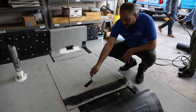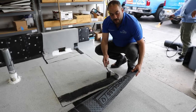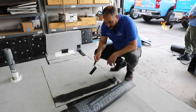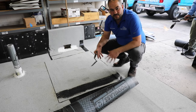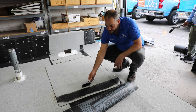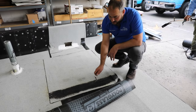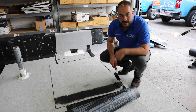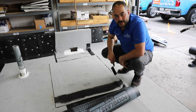What we did here was embed all those granules into the asphalt. That way when we flop this over, we're not burning the new material onto granules, which wouldn't bond as well. With all those granules gone, we're going to have a real smooth, tight, clean finish. He was using his trowel as a guide not to overheat this area of the roof, keeping the heat on the left side where we want to get rid of those granules. So now we're ready to flop this over, burn it, and get a nice tight seal on both the end lap and the side lap here.